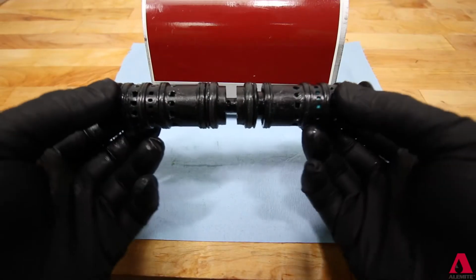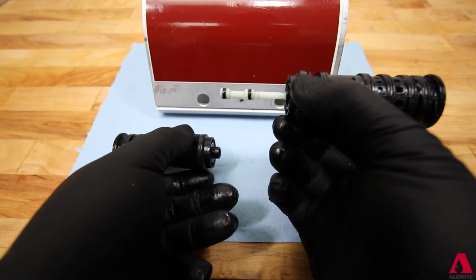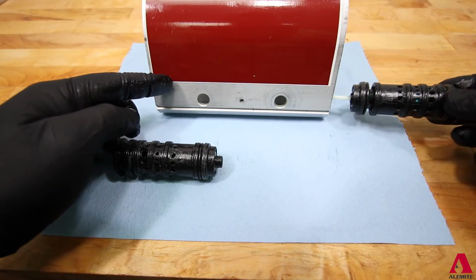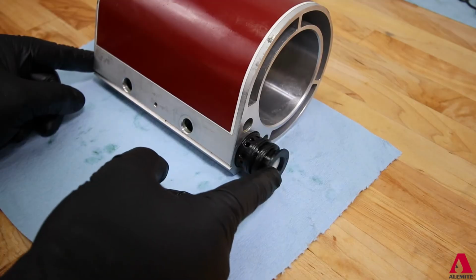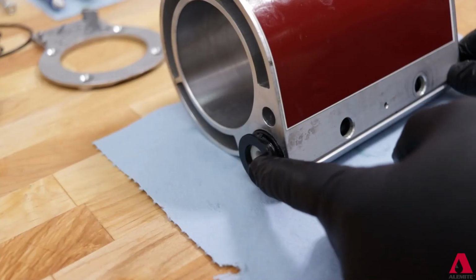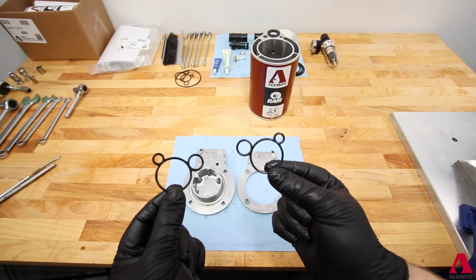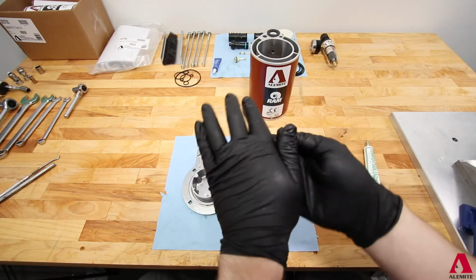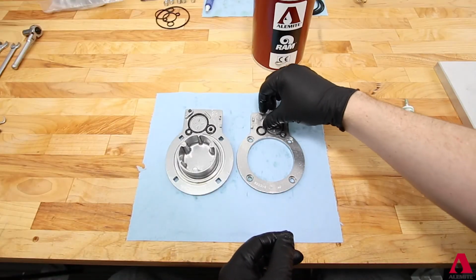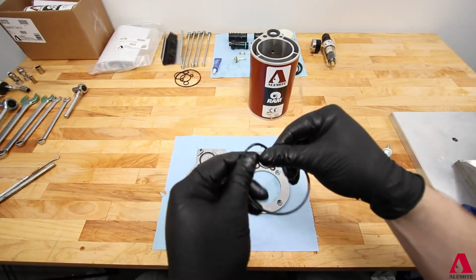Split the air valve spool into components as shown. It will not matter the direction this is installed. Slide the first half into one side of the spool cylinder, then repeat the operation for the other side, firmly pressing the exhaust adapters flush with the cylinder head. The end caps have a tri-port gasket to install. Be sure to liberally lubricate prior to installation. This will aid in securing the gasket in place during assembly. The top cap has an additional O-ring to place in the groove.